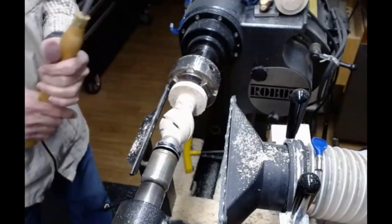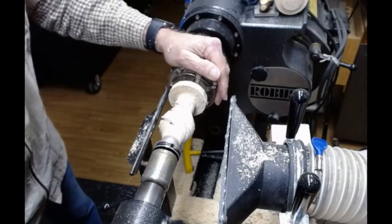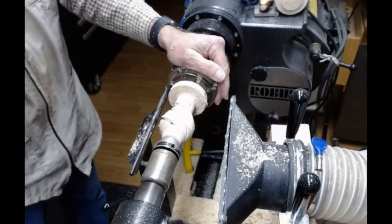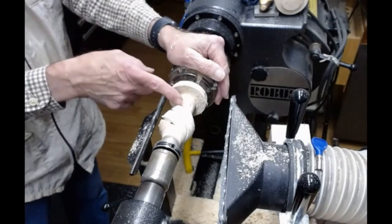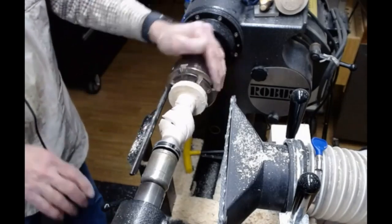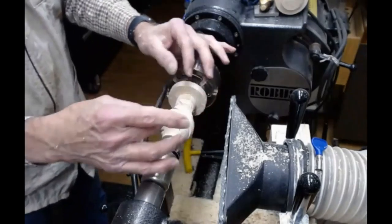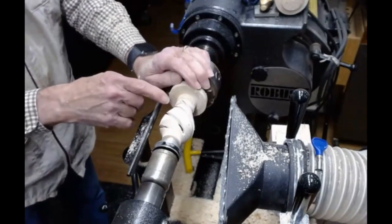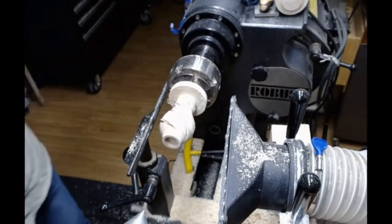Walt, could it be that you measured the small hole's distance, and to help you would have measured the larger hole distance? Well, the answer is yes, but that's where it cut off, at the larger hole, because the smaller hole goes down. One of the things that some people use is a set of tapered drills. There's a drill actually called the tapered drill that will drill a hole that's progressively more narrow, so you don't run into that. I'm going to double check on this one, make sure I don't do the same thing.